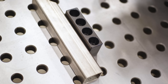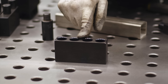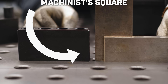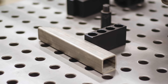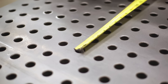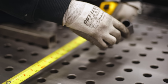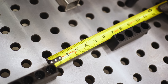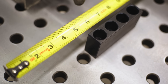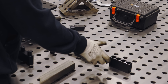Because it's a block you can clamp to it. One stop allows you to align with the axis of the table and clamp to the surface. This does rock back and forth, but what you should be using is this edge right here — by turning it this way that is a perfect 90-degree corner that doesn't twist or move. This is the proper way to use this fence block. If I wanted to space this tubing out on any dimension from 1, 2, 3, 4, 5 all the way up to the width of the table, I can make this block land on those numbers because the pins on the bottom are offset. They're set 6 inches apart. So if I wanted 5 inches I'd spin the block 90 degrees, drop it in the hole and get 5 inches. For 4 inches, move one over and flip it around — there's 4 inches. You just keep working the blocks back and forth.